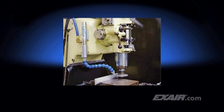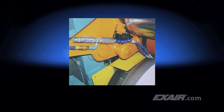It is commonly used to cool fly cutters up to 460 millimeters in diameter, which helps increase the speeds and feeds and improve the overall finish of the part. You're sure to find the cold gun used in unique applications like this one, where the cold 20 degree Fahrenheit or minus 7 degrees C air chills the roll to keep the material on the surface from bunching up, jamming, or tearing.